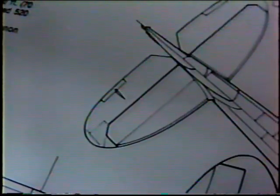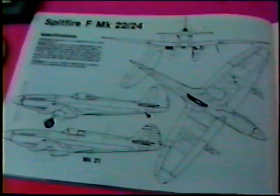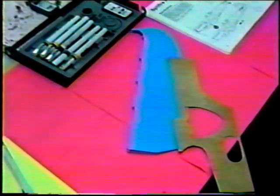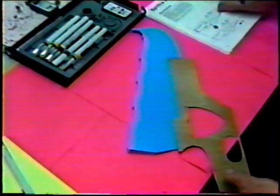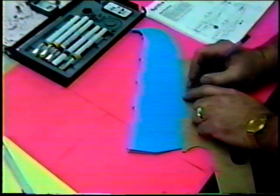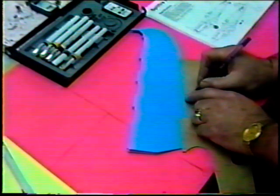Now I can look at this and see this is roughly 1/3 the span, and I can interpolate this roughly to get a number so I can make up a template for that little tab. And this way the top, the bottom, everything will be equal. Well, one of the best materials to use for this is good old-fashioned 64th plywood scraps. Again, I'm looking at my book, trying to just picture in my eye how big this should be. I'll cut this out with a scissor to dress the edges off and put tape on it, and I'll have a pattern here.